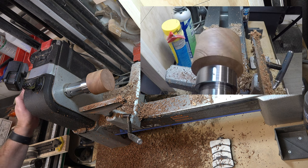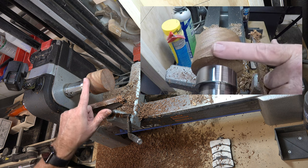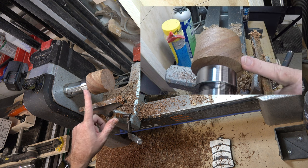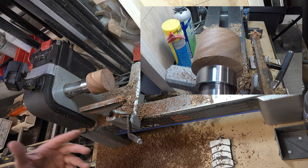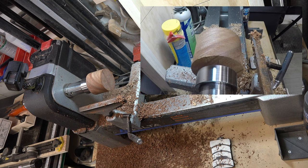The shape on the plans for this toy is nothing more than a suggestion. If we're going with the plans, the first thing is to turn the diameter right up at the collet to two and one-quarter inches. I don't think we need a video of that — it's the same as turning round — so just get this turned down to two and a quarter, and then we can carry on.